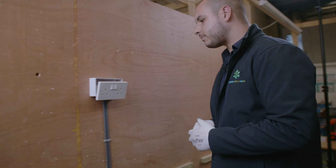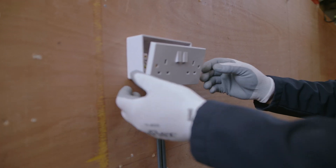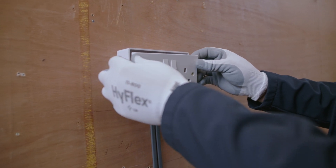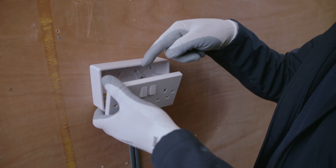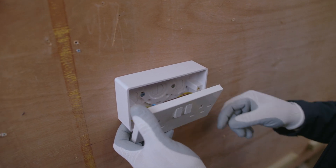So if you follow me this way — basically what we're going to be looking at here is, like I've just mentioned, the socket front itself — the faceplate. When you've come to inspect it, that's as far as you can get it. So if we look inside, the neutral conductor in this case seems to be quite short.